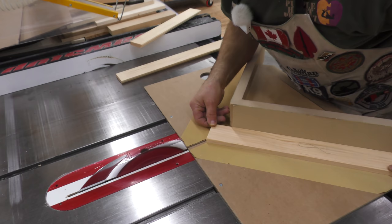In fact, this is not perfectly flush. Let's see if I can do it by hand right now. Problem is that if it isn't, the clamp is going to put all the pressure on one side and none on the other. All right, that's better. Two clamps should be enough. There, now I'll go through and do that with all the others, but I've got to go in here first and clean this up so, like I said, we get even pressure once we apply that clamp.